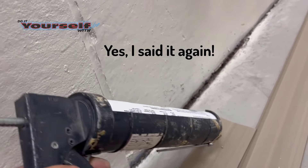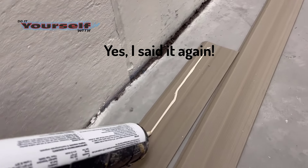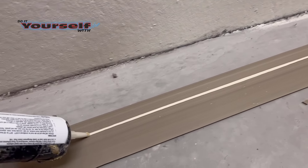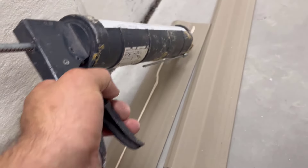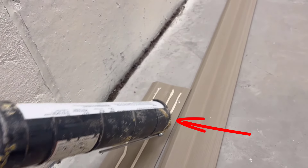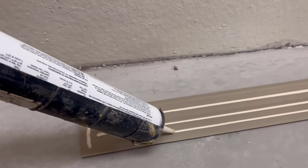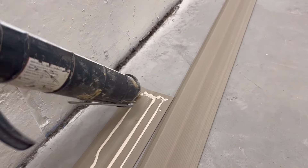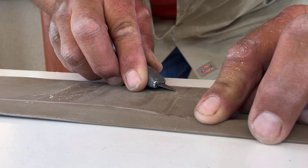When applying glue to the back of the rubber base you only need three one-eighth inch thick strips. When putting the strip of glue down toward the top of the base, stay about three quarters to an inch away from the edge — if you don't, the glue will squeeze out as you press the base against the wall. Also put a bead along the edge; this will help when you're working a seam and putting two pieces together. I hope this helps — thanks for watching.